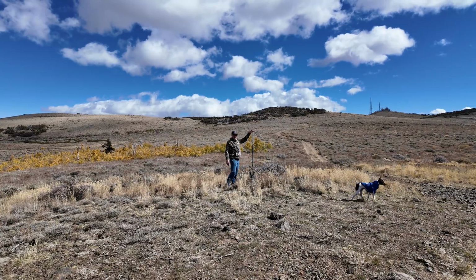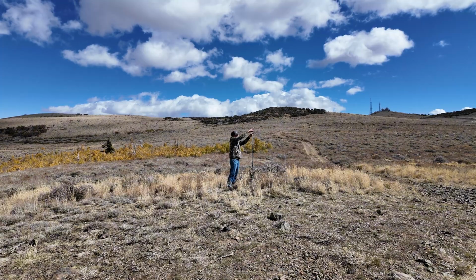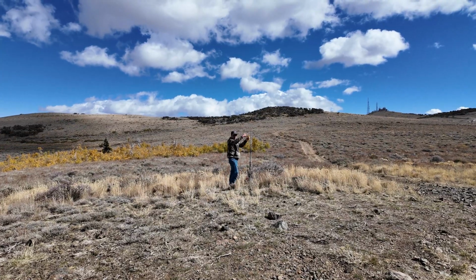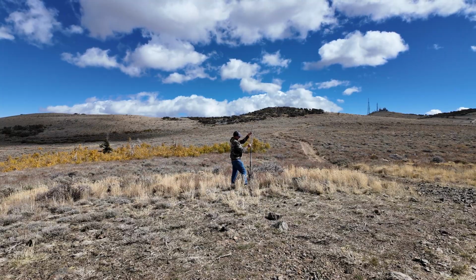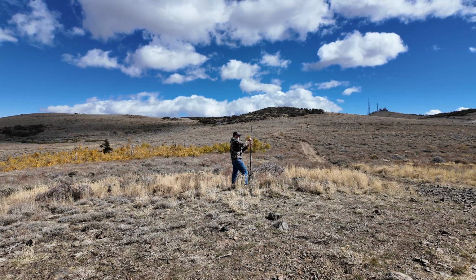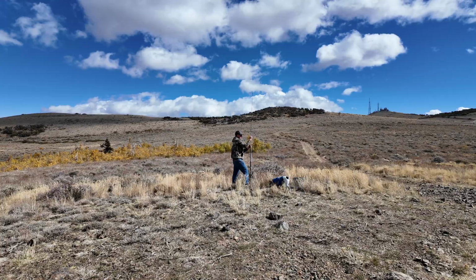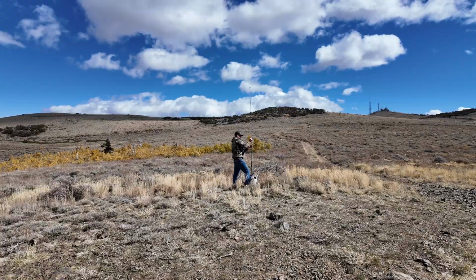Okay, so I've slid my Slinky over the top. I have that plastic contraption I made for the top going over my mast. And then I pin down the 9-to-1, so that way when I raise the mast, the Slinky won't pull everything up. So I'm gonna go ahead and start raising the mast, or the fishing pole mast. And then each section I raise, I wanna give it a twist too to make sure it has a good friction lock, because it is going to be under spring tension now trying to collapse this mast with the Slinky. So I want to make sure everything's good and tight.